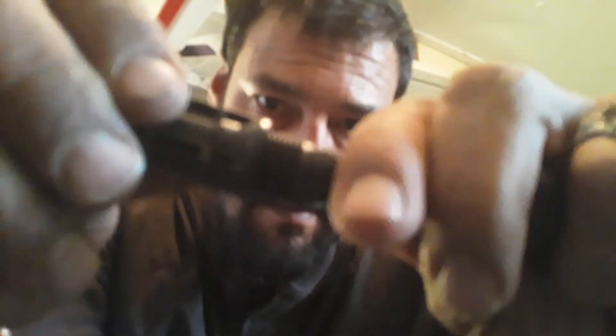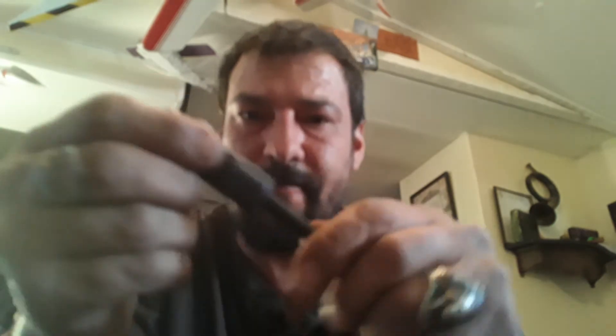Make sure that goes into the grommet and you should hear it snap. I don't know if you heard it snap but it sounds like a toothpick snapping. I don't have one of those tighten-up thingamajigs so I use my hand to tighten it. As long as there's no gap in between, perfect — look at that. And that's how you make the MC4 cables on an 8-gauge wire. I hope that helped some of you out. This is Master Syce — try not to break a sweat, peace out.